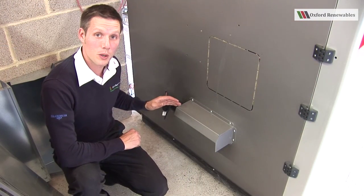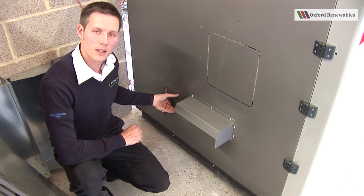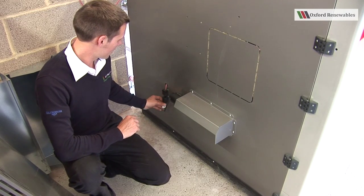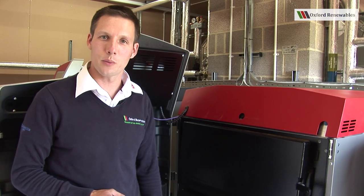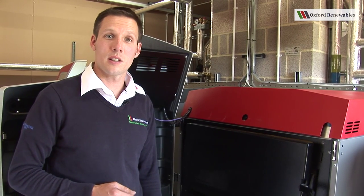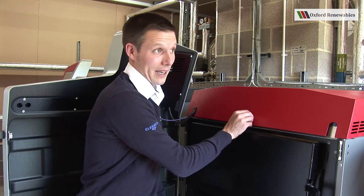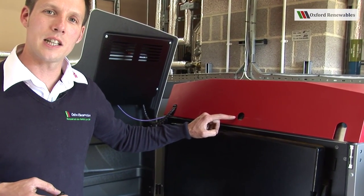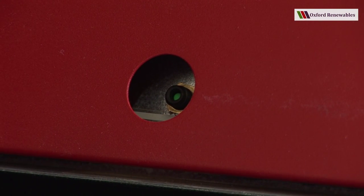This component is the boiler's ignition system — it's a hot air blower that blows air at over 400 degrees onto just above the grate to ignite the pellets. The electrical connection is made here. In the case that you experience an over temperature event, the boiler will ask you to press the thermostatic reset button. That's just here — you have to screw the black cap off and take it away to reveal a green button underneath, and you need to push that button in with a bit of stick or a biro or something like that. You'll only be able to reset the machine once the boiler's temperature has dropped below 80 degrees.